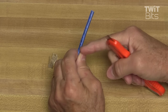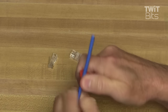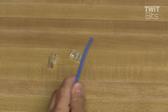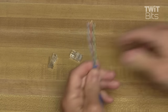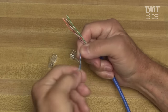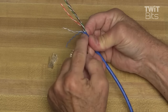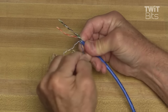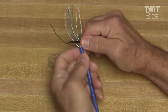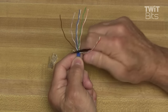First thing we need to do is strip back some insulation off the wire. We'll strip back several inches, more than we actually need to go into the connector. We'll score the outer jacket, being careful not to nick the conductors on the inside. Twist it back, break it off. And now we'll untwist the individual conductors, a little further down inside the jacket. Once we've got all the wires untwisted, we'll just use a screwdriver blade to straighten these and to take the remaining kinks out of the cables.